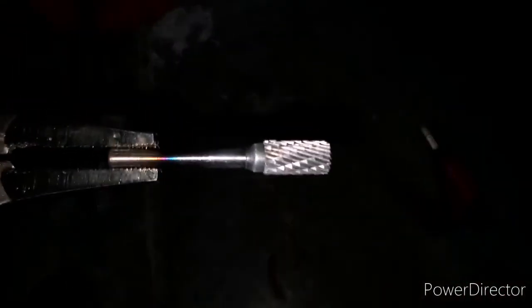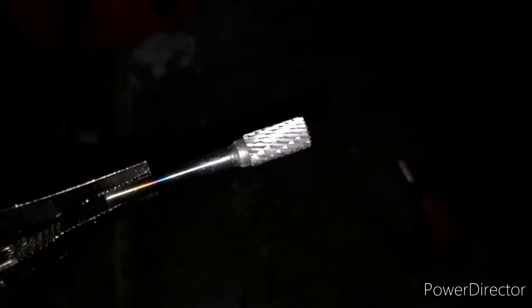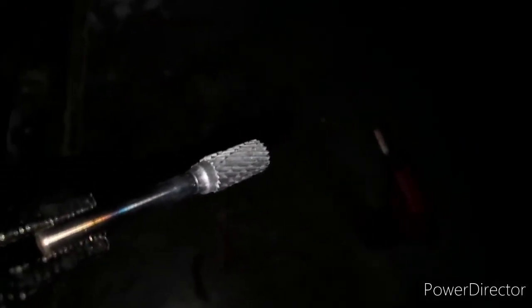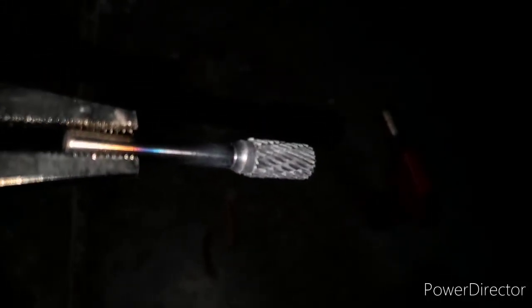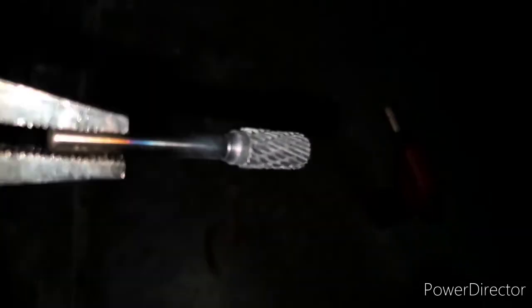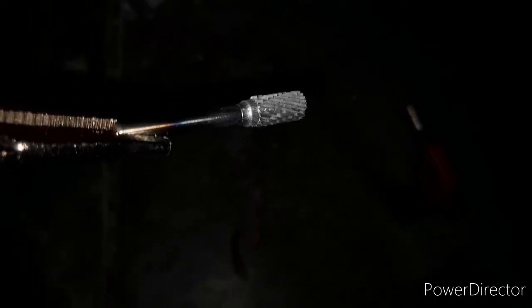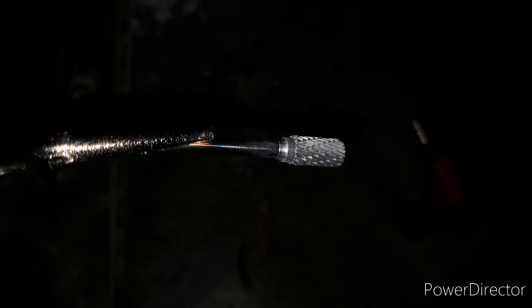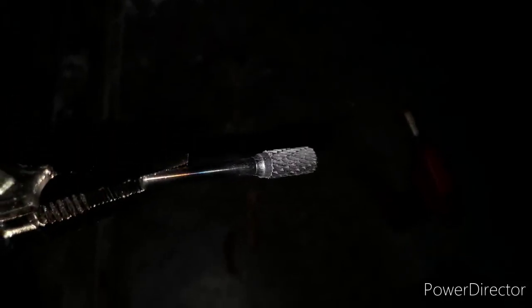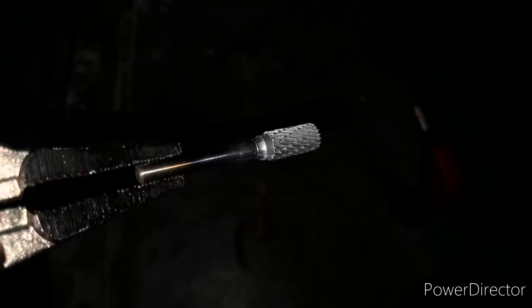And that is it. As you can see — I know it's hard to tell — but that bit is clean now. There's no more aluminum in that bit. So instead of having to buy a new bit because the aluminum is basically welded in there, all you gotta do is heat it up till it's red hot, take your steel brush, and just brush it all out. I just wanted to show you guys that — I was gonna buy new ones and I was like, man, there's gotta be a way to get this out. Just heat it up red hot, brush it out, it's good to go. Alright guys, this is JOATD, hope this was helpful, and I'm out.